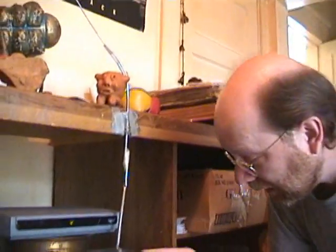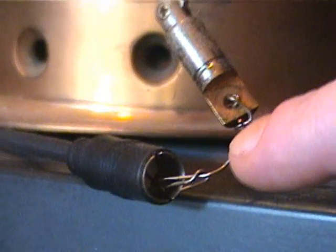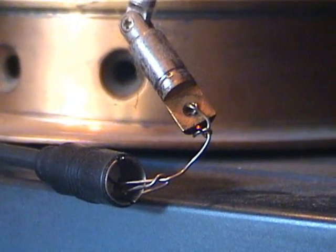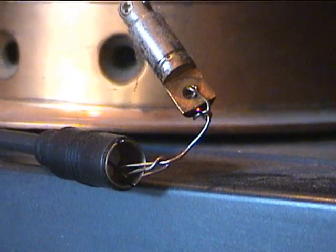Was there a purpose to bend and tape it? Well, analog-wise, there was a purpose just to get a better picture. As you know with digital, when the picture is not good it just goes out. I wrapped a paper clip around this part and then put the other end right inside the RF cable on the little prong in there.